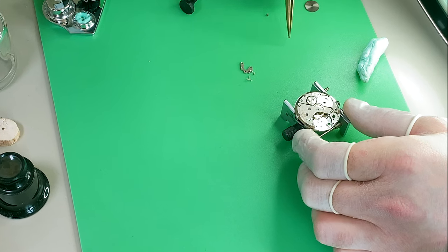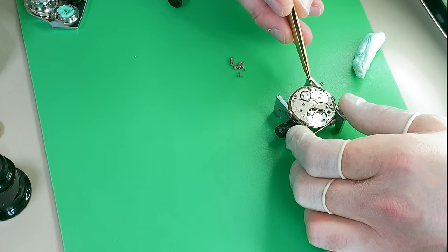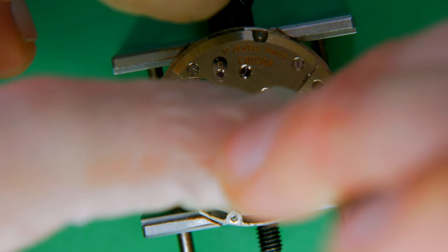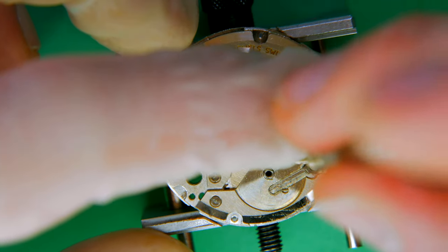And that's the clicking noise that you hear, obviously, when you wind your watch, if you didn't know. All the noise that you hear when you wind it is coming from that little tiny piece when it keeps slapping back against the ratchet wheel. So it's basically keeping the ratchet wheel under tension, or the mainspring under tension.